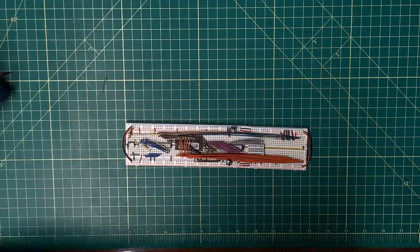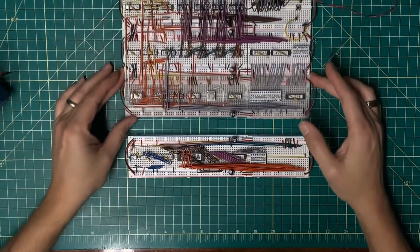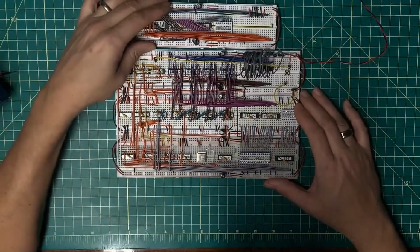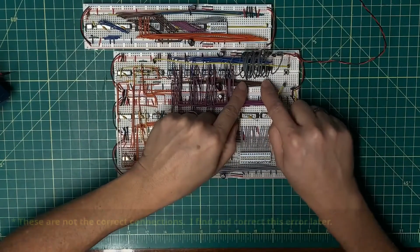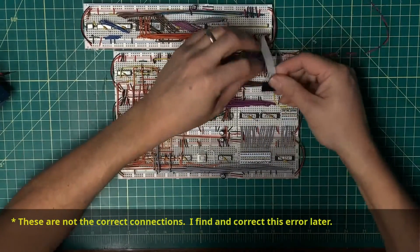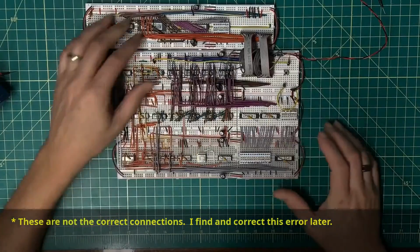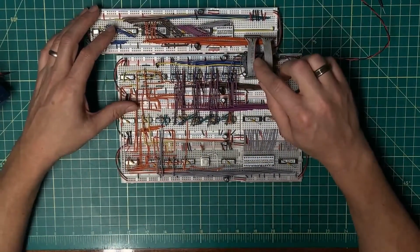Okay, well, I think the next order of business is to take this EEPROM module and connect it up to this Control ROM Control Module. And I think I want to do it this way up here, because my address lines that are going to feed into here are these brown signals here. So I should be able to jump them together in something like this. It's a little tight, but I think that'll work. All right, that's the easy connection.